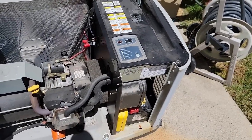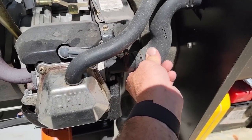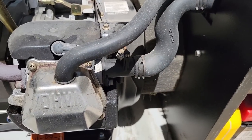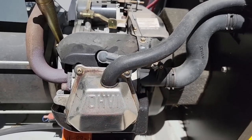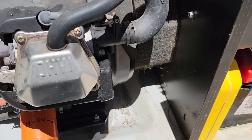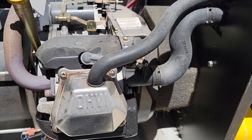They said the battery was replaced not too horribly long ago, so hopefully that's not the issue. Now I do know, because this is back when I first started, we used to have problems with the bellows rotting out, but it doesn't look like this one has bellows. But that's not very strong — see that where I didn't even hardly move it, it was just sitting there like that. This is required to get gas into the engine. The downstroke of the piston pulls the fuel in through the air box from that little regulator at the back. That regulator has a tendency to stick. This is one of the units that I just don't particularly care for. It's great if it's a gas powered one, but I just don't like it for natural gas and propane because they have no choke, no way to really get them going.